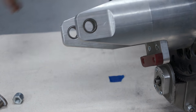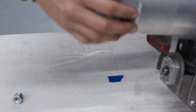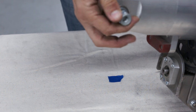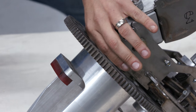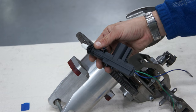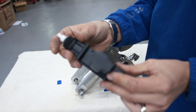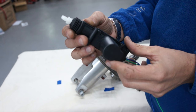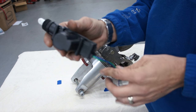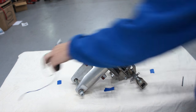Now, as I just previously mentioned, it is an electromechanical setup. So I'm sure one question you might be asking right now is, well, where's the electrical part? Well, the electrical part is right over here. This is what the actual electrical component of this electromechanical pre-rotator looks like. This is a simple solenoid — I believe this is used for actuation of automotive door locks. So this is what actually activates the bendix inside the rotor head and pops it out, and I will show that to you right here.